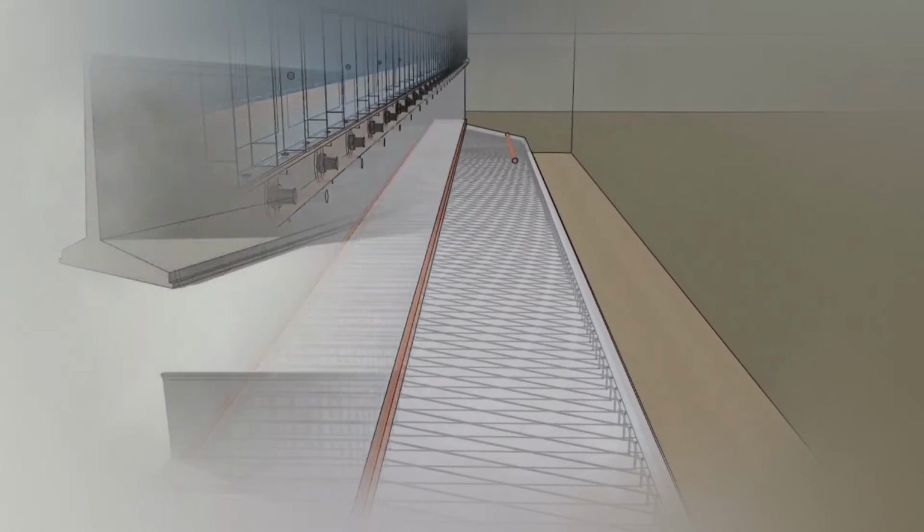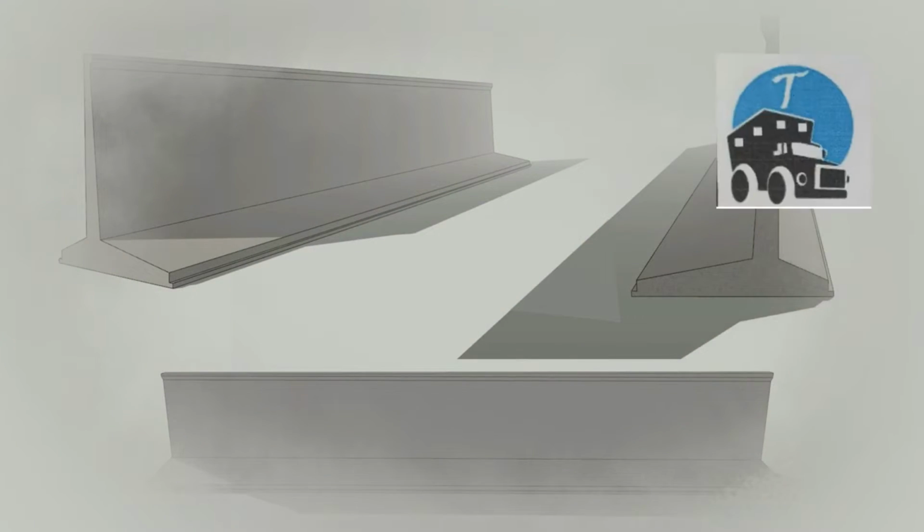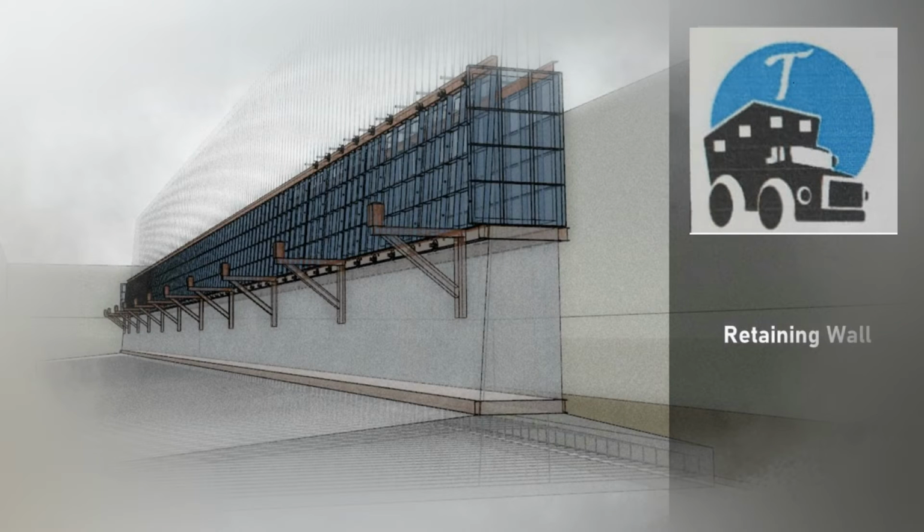So after construction of the retaining wall, it will look like this as shown in the picture. Retaining walls are vertical or near vertical structures designed to retain material on one side, preventing it from collapsing or slipping or preventing erosion. They provide support to terrain where the soil's angle of repose is exceeded and it would otherwise collapse into a more natural form.